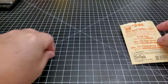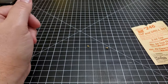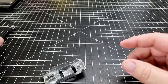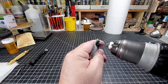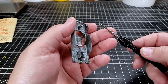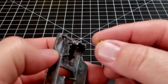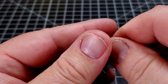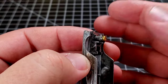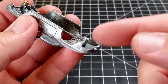Along with the tap and drill set, you will need these little itty-bitty 2-56 screws — these happen to be a quarter of an inch long, which is quite long enough. The last special tool you might already have is a pin vise; I'll be using this with the tap or a power drill. When tapping these drilled holes, I use a pin vise with my tap, and you want to start very slow with nice, even pressure, keeping it nice and straight. Then I take my little screw and see how well it fits — and that is flush enough. If you don't get it deep enough, even after tapping, just get your tap drill out, drill deeper, and re-tap. It's not going to hurt a thing.